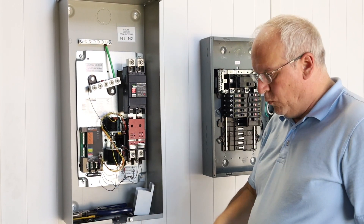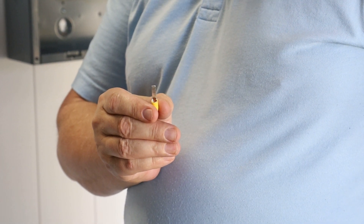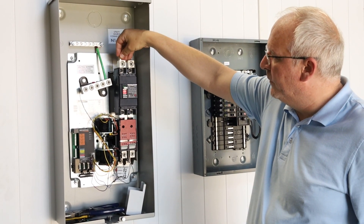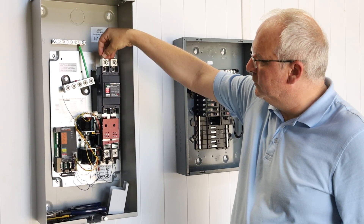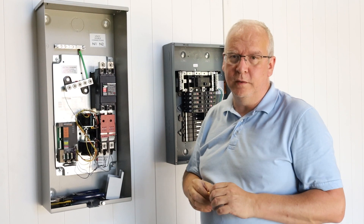We ship the Vortex Series R with blade terminals, which look kind of like a spade terminal but the blade is about an inch long. You'll clip these onto your line conductors and insert them behind your service entrance conductors in the lug.